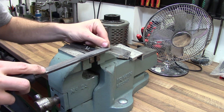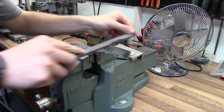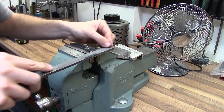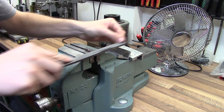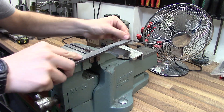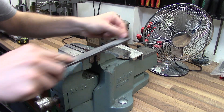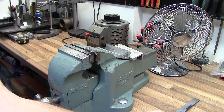This stuff is extremely soft, so obviously use quite a fine file. Just keep checking it for depth, and obviously you want to make sure that you're filing it flat too. Just keep filing it and checking it because it will be surprising — I'm already halfway there — how quickly this carbon actually comes off. Just keep checking, making sure it's nice and square. Nearly there. As soon as it's flattened out with the other bit of flat there, it's about as far as I want to go.